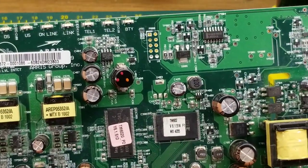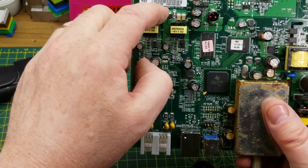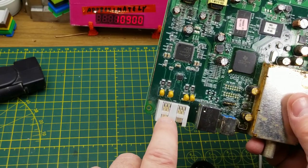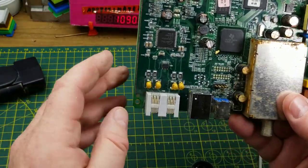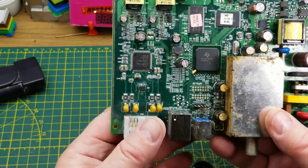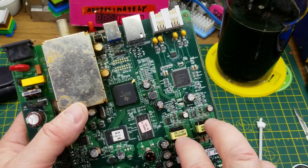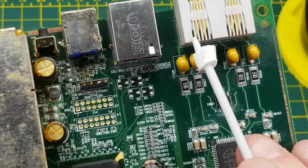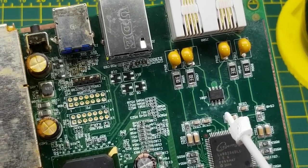Over on the left-hand side, those transformers, the big diodes and capacitors lead me to believe we are talking about the two phone lines — the two RJ11 jacks. And they're not paralleled; they're two completely separate mirrored circuits. The data sheet confirms the device can have two different VoIP lines. There's some line driving and isolation from the line in there. It's even got a pair of 330-ohm resistors — one for each line — to match the 600-ohm nominal impedance of a standard phone line.